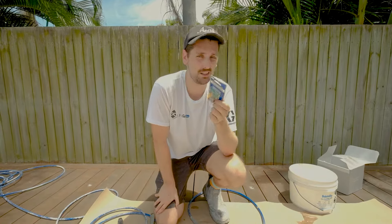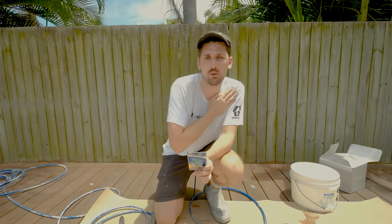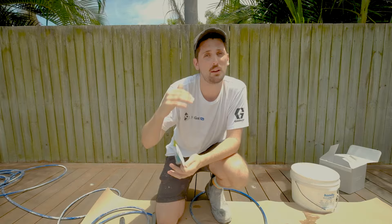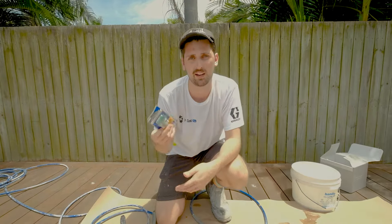The next two numbers is the size of the orifice in thousandths of an inch. That probably doesn't mean too much to you, but we've got a sprayer lookup table where what material equals what tip size. For all Tint products we've put in the hard work for you — we've done our testing and we've got a sheet of recommendations. Right now for gutters with Tint exterior product, I'm going to be spraying with a 310, or I might change to a 312 depending on how I get this dialed in.